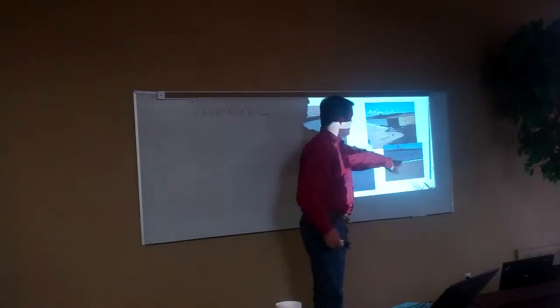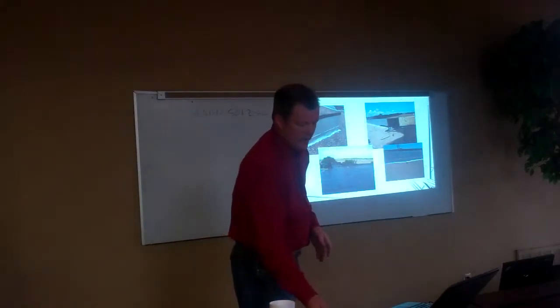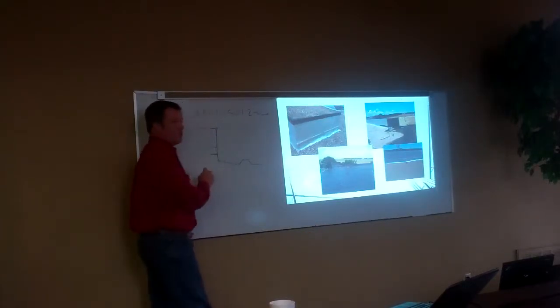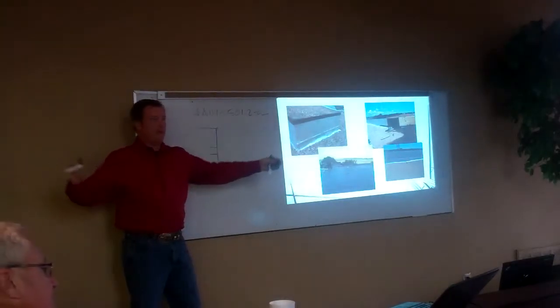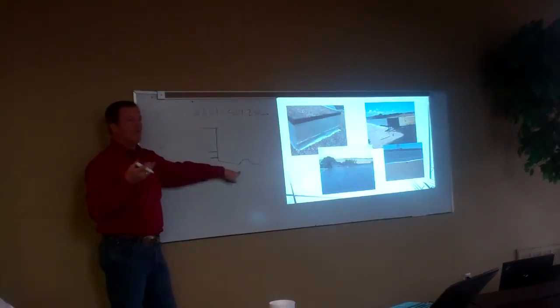One of the things I would point out: when you have scuppers at a roof drain, an existing roof drain — does everybody know the rule of thumb for locating overflow scuppers, emergency overflows? If you see someone trying to put a scupper in a wall that's four inches above that drain, you have a problem. The building engineer designs the structural load for dead load and live load to handle at least 20 PSF, which equates to a four-inch head of water over a certain span. The code wants that scupper to be no more than two inches above the primary drain, so at no time can that roof carry more than two inches of pond water.